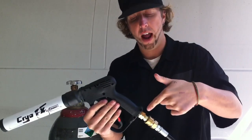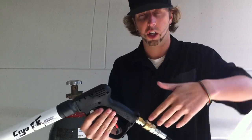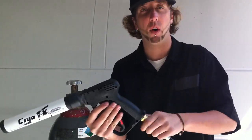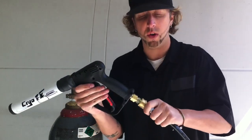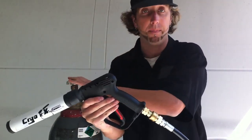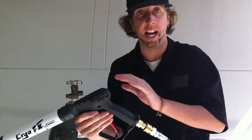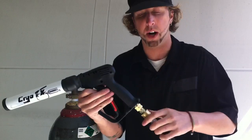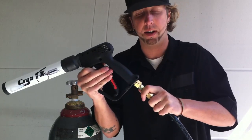Precaution: don't ever remove this cryo gun when this hose is under pressure. You'll spray CO2 all over the place and waste your whole tank. That's very important and it's also listed in the manual. Don't detach these if the hose is under pressure and the tanks are on. Wait until you turn the tank off and spray all the CO2 out that's remaining in the hose so it's no longer under pressure. Then disconnect this fitting.